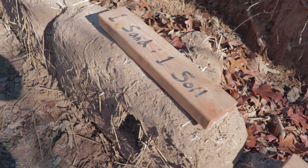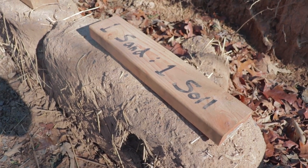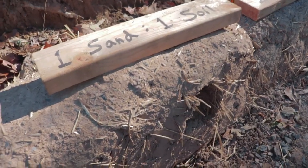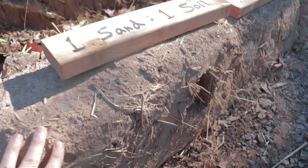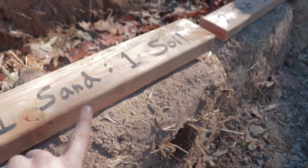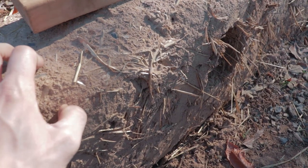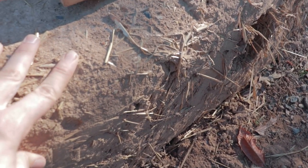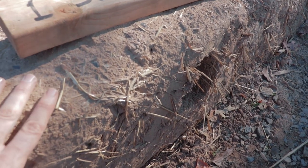Now we go to a better ratio. The ratio is always going to depend on the type of soil you have, but in most cases a one-to-one ratio will be good. You've got to check your own local soil and test it, but a one-to-one ratio is usually where you start. This one turned out really well — one part masonry sand, one part soil. It's a very good, solid cob using regular masonry sand. It was very sculptable and pliable, didn't need to be too wet, and it stacked high really well, so it dried in good time. This is your traditional cob.